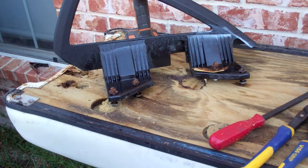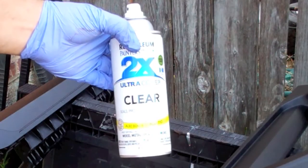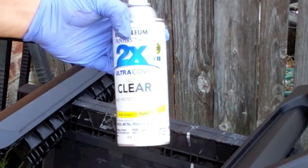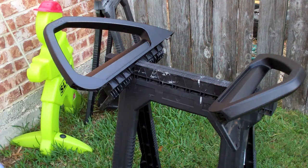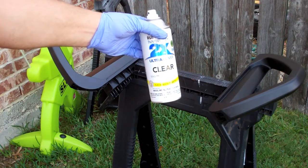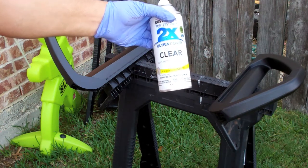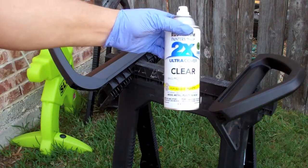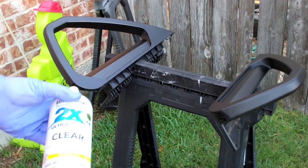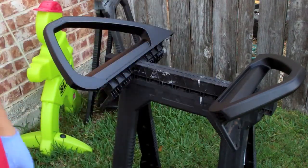Then I've got to figure out what I want to do to reattach them. I got both of them painted black, and I think the best thing to do is hit them with a gloss clear coat that's non-yellowing and UV resistant. If you just leave the black paint, it'll probably only last about six months in the sun before it starts looking bad again. This seems to give it a longer life — I've sprayed things like a year ago with this and they're still shining, so I think it lasts at least twice as long. Highly recommend you do this — just spray it right on top of the black.